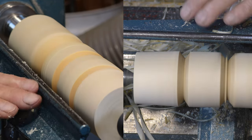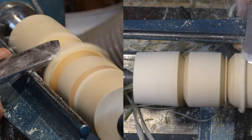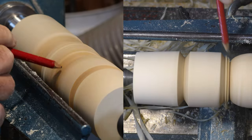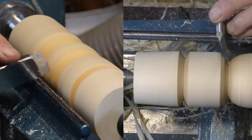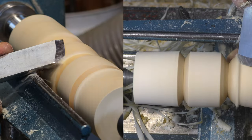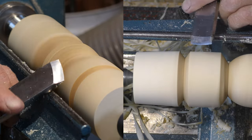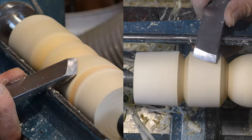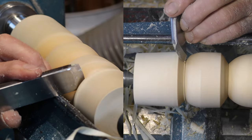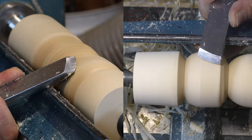When you're cutting a bead, you've got two options. One is to use the short corner and take that around — the tool goes along the rest as it rolls over. Using the short corner, you go along the left and roll as you go. Or you can use a slicing cut just behind the short corner and roll the tool over. It's slightly more difficult because you're really inviting a catch — you have to be a bit more secure with your grip on the rest.